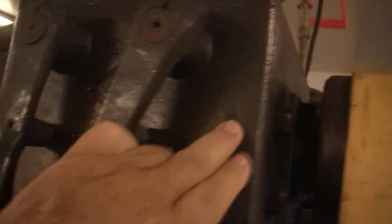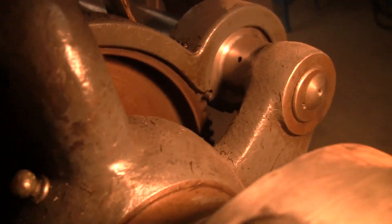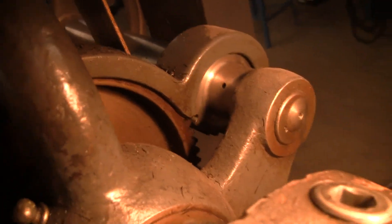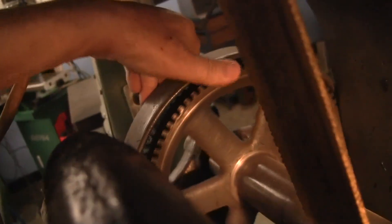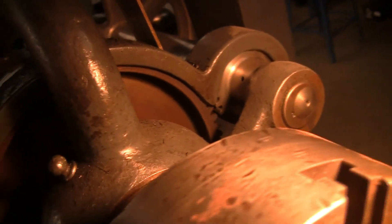The different speeds: the top speed is 420 RPM and the lowest speed in back gear is 25 RPM. The back gear has been repaired — it came this way. Somewhere, somebody put a bunch of pins in place of where some teeth had been knocked out. I really thought that wasn't going to hold up, but it's held up ever since. There's a bunch of pins in place of teeth and they've never given any trouble.